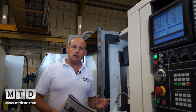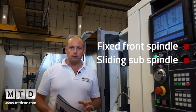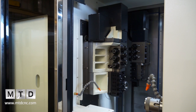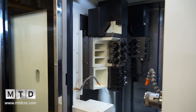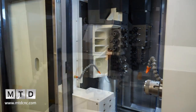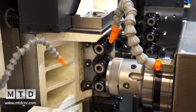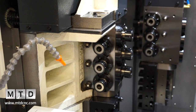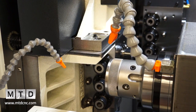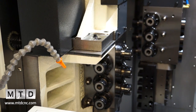Your front spindle on this machine is a fixed spindle and the sub spindle is actually a sliding spindle. We have a platen arrangement as opposed to a turret arrangement. This is where we can potentially improve cycle times because we can move from tool to tool in very quick succession. It also means that we can do both milling, drilling, and off-centre work using our Y axis as well.